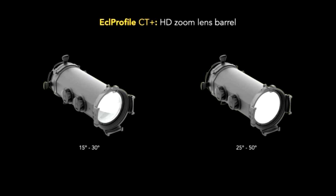they make our fixture look great, and the clarity when you're focusing in and out, let's say you focus on a pattern at full white, as you shift colors, red, green, blue, you're not seeing an aberration, you're not seeing a shift of the focus. So given the lens tube cost, I would invest in new lens tubes. They're well worth it at that point.